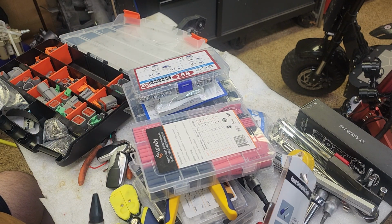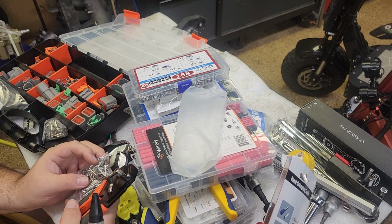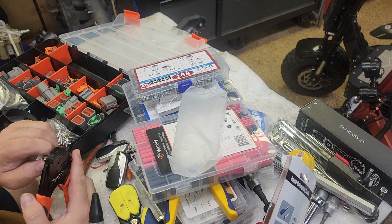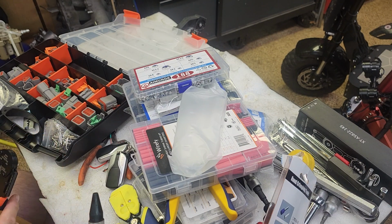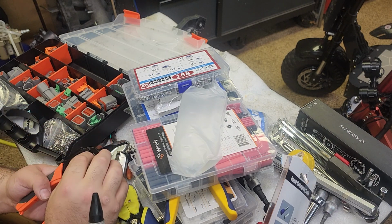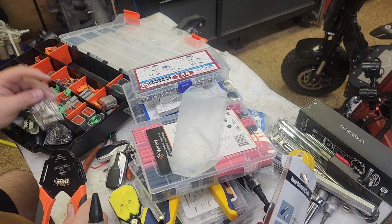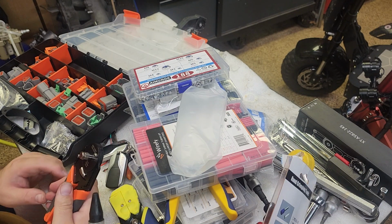They give you a crimper with this set. I love these crimp styles. These are barrel crimps. So you could slide the pin in. It actually has a stopper, so it stops there. And you can set the depth too, how far you need it to go. But you drop the pin in, stick your wire. It's basically a two-hand operation. Crimp it. It squeezes down. You get 4 points of connection when it crimps it, and you have a nice secure pin. This is a nice ratcheting.